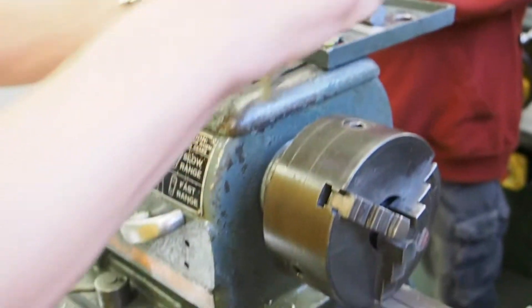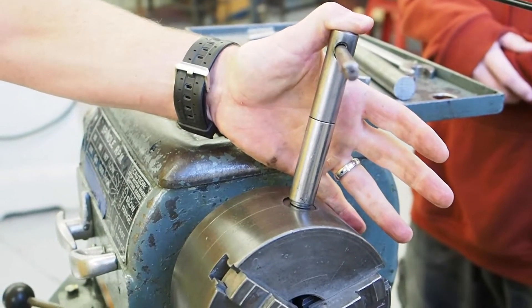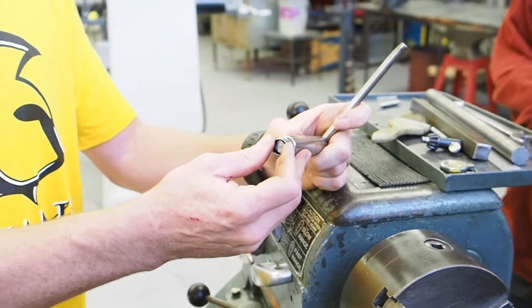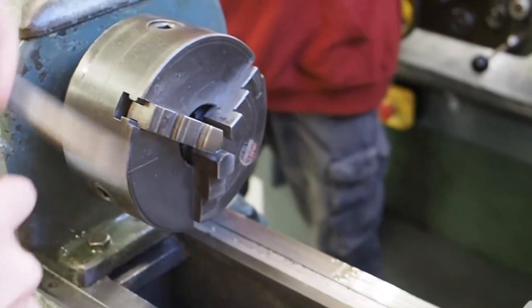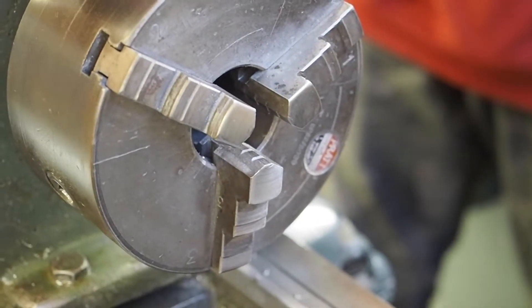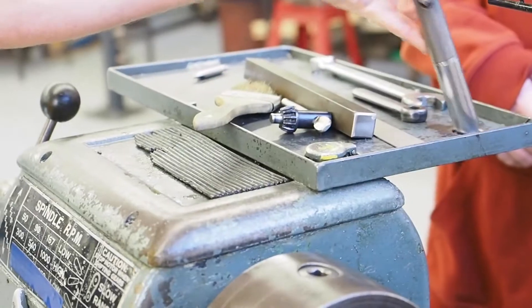So when you go to do any work and open and close the chuck, never leave the chuck key in the chuck. We're very lucky here at the school to have spring-loaded chuck keys. What that means is you really can't leave the chuck key in there because as you let go it pops out. But this isn't the case everywhere you go, so make sure any time you're using the chuck key you take it out — never take your hands off of it. The jaws are opening as I'm spinning the chuck key — that's how you get the chuck to open and close. When you put your workpiece in, make sure you take the chuck key out and put it back in its proper spot.